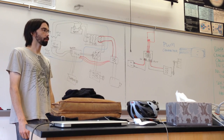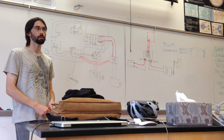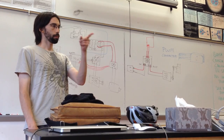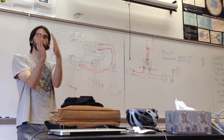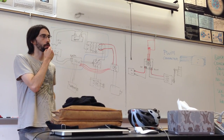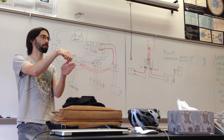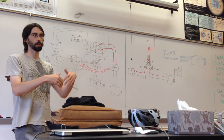Servos will just kind of stop if you try to lift something heavy. They're useful for opening small things, moving stuff around — maybe repositioning something in your robot, like the angle of a shooter that only needs to be moved up and down a little bit. We don't think we've even used any servos on the full-size robots because they're just not really powerful. The only thing we've used them for in the past is for a camera mount — changing the position of the camera, or rotating it around. Also occasionally they use them in gearboxes to shift gears back and forth to different ratios.